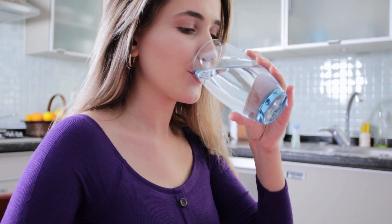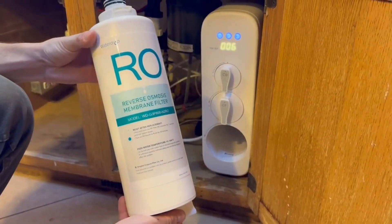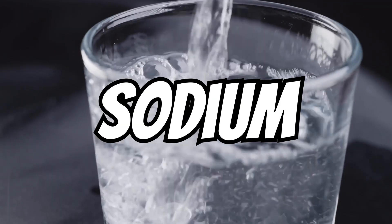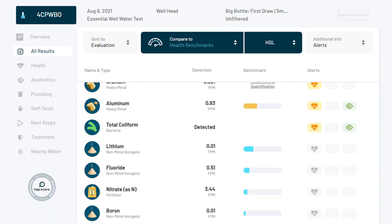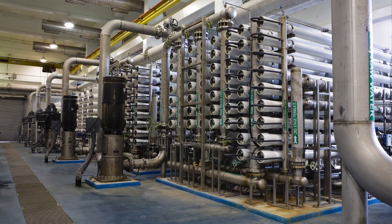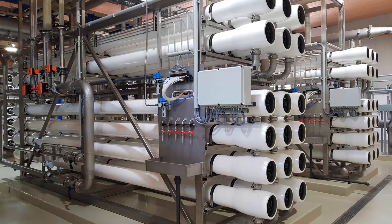The best, most practical way to remove salt from your water at home is with a reverse osmosis system. RO systems can eliminate between 85 and 99.9% of sodium from drinking water, along with hundreds of other contaminants. In fact, the RO process is so effective at separating salt and water that it's often used in large-scale seawater desalination applications.